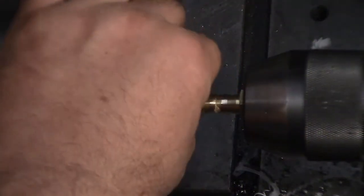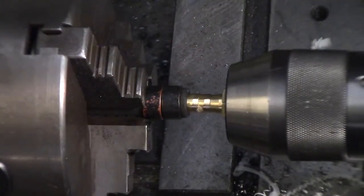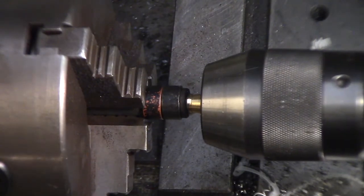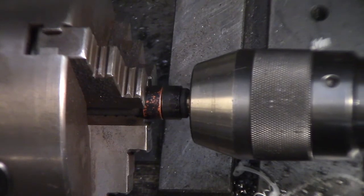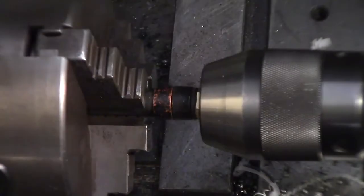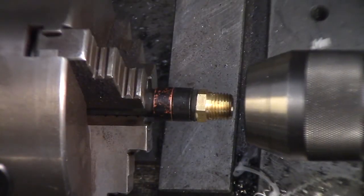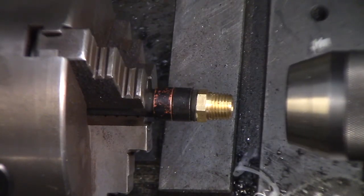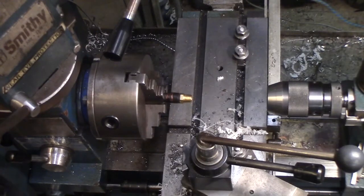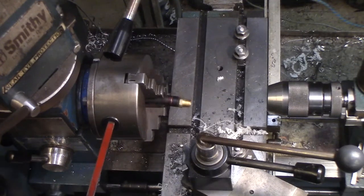In this instance, I put the ferrules all the way up on the hose to begin with, and we're just going to cram it in there and fight the friction that we have. And that's another reason for taking off the sharp barbs. This way the hose isn't moving around in the ferrules and they're all getting in about the right place I want them to be. Either one will work. So just trying something a little bit different. Now I think we're ready to go do some squishing.